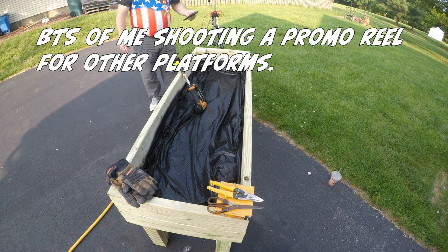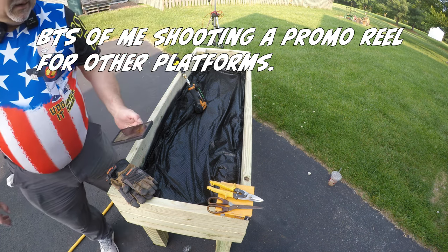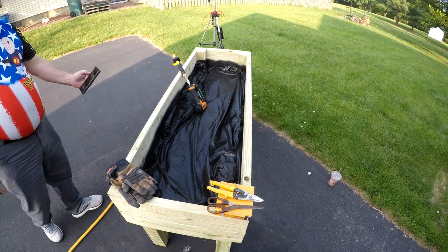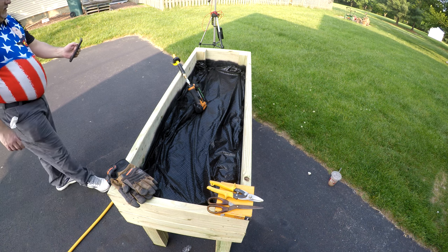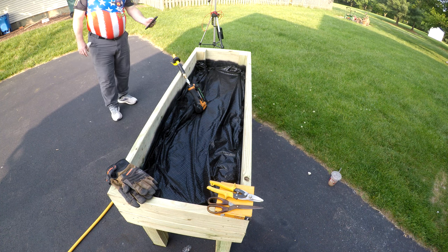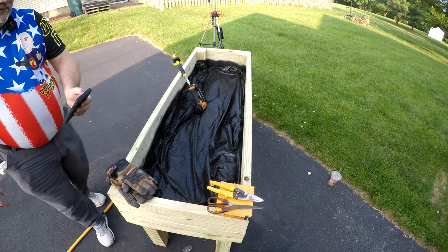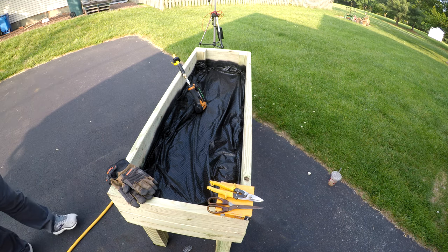All right, so now we have the fabric installed in the bottom. So this is now over top of chicken wire. The chicken wire is to give it the extra strength so the dirt doesn't collapse the chicken wire. And we also have 2x6s and 2x4s giving extra strength underneath with 3-inch screws. And all this construction is 3-inch screws. There's at least 3 screws per board into each 4x4. And the 4x4s are 2.5 feet tall. So this structure is 2x6 by 2.5 feet tall. So yeah, buddy.